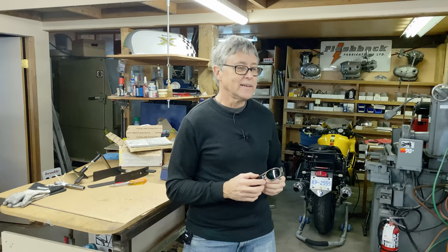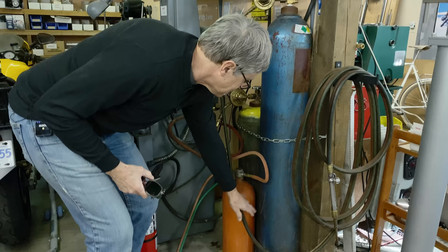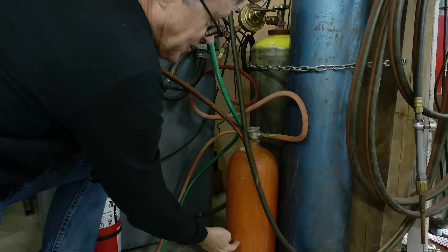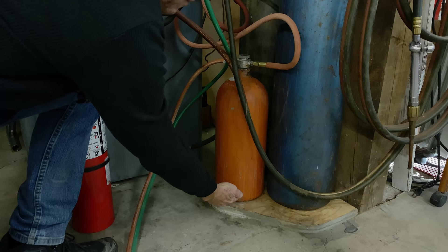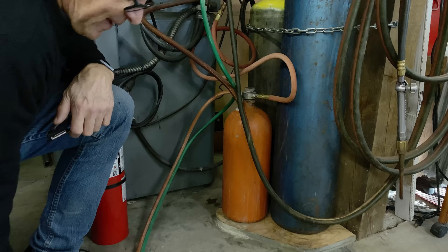Let's have a quick look over here at my oxyacetylene setup. The large bottle is the oxygen, the smaller bottle is the acetylene, and we have a fluxer — this is an automatic fluxer. There's a tube that goes down almost to the bottom with a level of liquid flux. The acetylene bubbles up through the flux, the flux gets absorbed into the acetylene, and it all goes to the torch. That's basically how the automatic fluxer works.